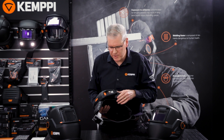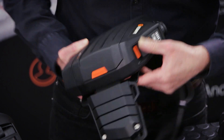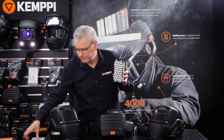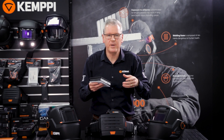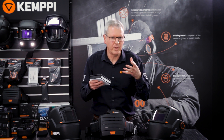Now let's talk about the filters themselves, because that's what we're focusing specifically on in this particular video. For the majority of applications most users simply need to be using the particle filter with the pre-filter. That accommodates the majority of welding work environments, but in order to understand what type of risks you're presented with within your welding environment, you really need to have an independent air quality measurement done on the premises.